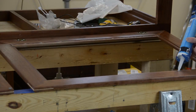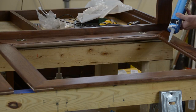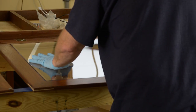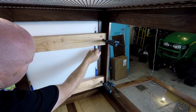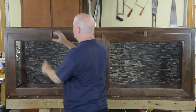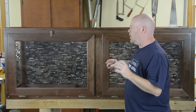The final phase of door construction is the installation of the Lexan panels that make the windows. I'm using 100% silicone sealant as my glue — it holds the acrylic really well, it's waterproof, and once it cures it's completely non-toxic. The side panels go in the same way, though I had to rig up a clamping system to press these into place since I'm not working with gravity like I am with the doors. Turns out I need some longer screws for these, but otherwise the construction is done.